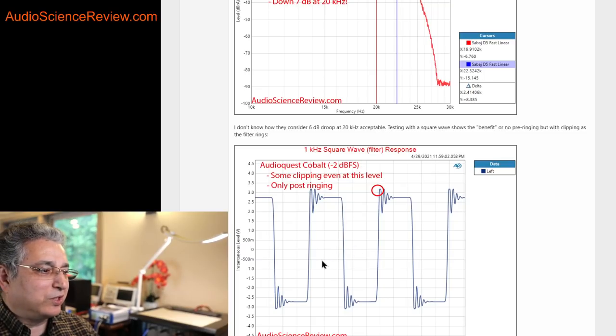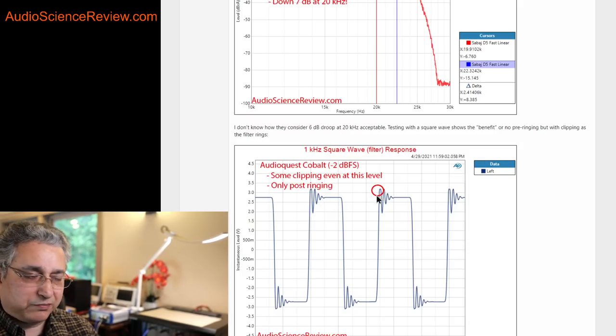Even though the utility of this filter is quite suspect, despite the fact that I'm running this at minus 2 dBFS — not even full scale — we see the tops of the waveforms are flat. They should be little points, not flattened. When they're flattened, the DAC is internally digitally clipping. When it clips, it generates distortion. This is an overflow — digital systems cannot handle overflow. They're great until you get to zero, and then they can't go above. So there's a signal processing error here. It's rather common, but still not forgivable. We don't want clipping in the name of a DAC filter.